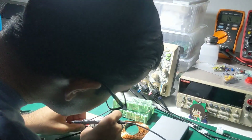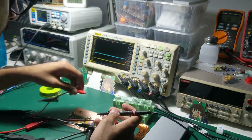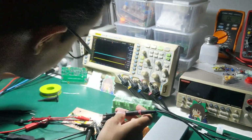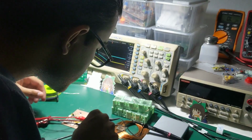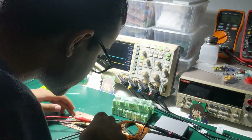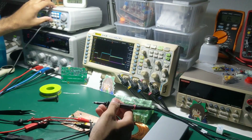Also, the supply is off. Yeah, I know. The SG3525 or something has complementary outputs. I don't care, I don't have it. I love my TL494. I even added a brownout detector to it. I bet if someone rips through a bunch of AliExpress stuff, they will find this circuit somewhere. Someone coping with the Chinese TL494 will have found this cursed solution and be like, yes, the holy grail of cheap Chinese yen.